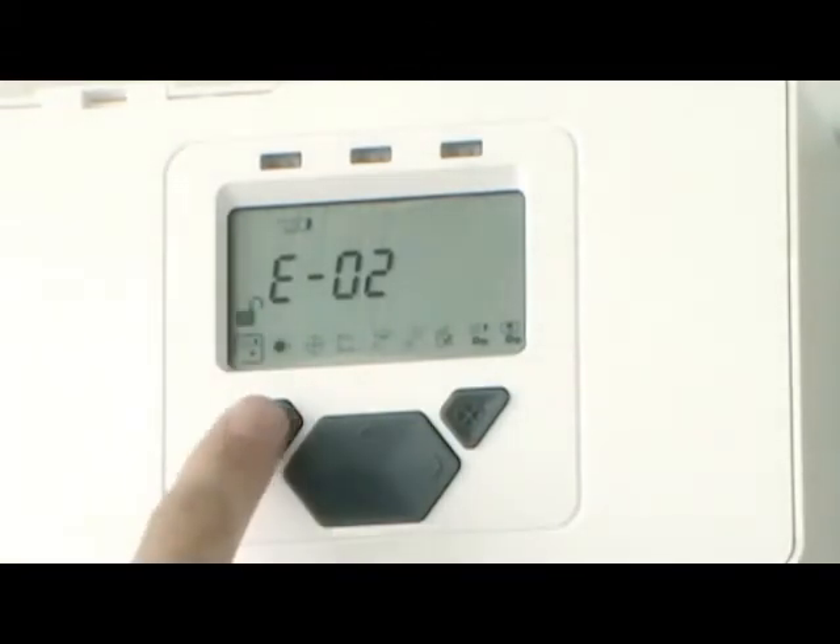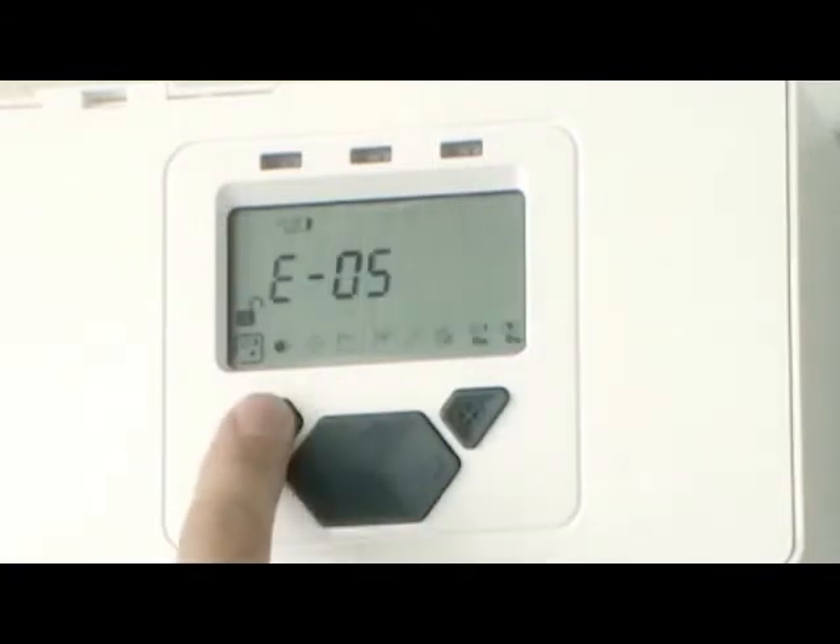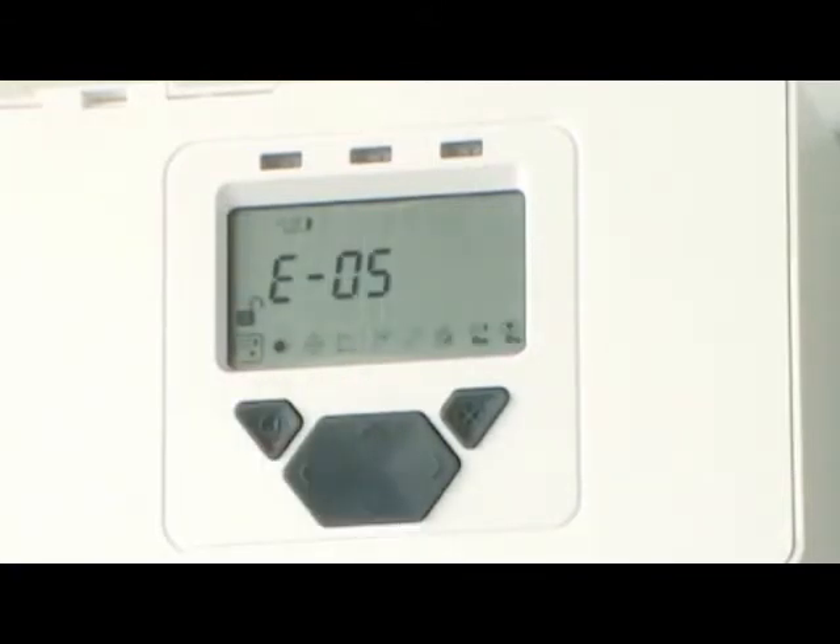To start the automatic Find sequence, press Tick a second time. The display shows a countdown whilst finding receivers. If one receiver is connected, the countdown will take 10 seconds. If two receivers are connected, the countdown will exit as soon as both receivers are found. The receiver icon at the top left of the display shows which receivers have been found. The display also shows 2R to indicate the number of receivers found.